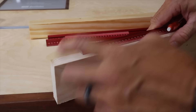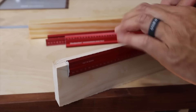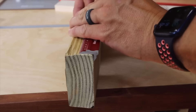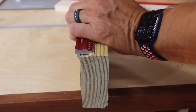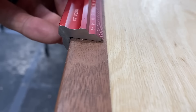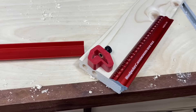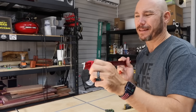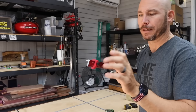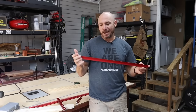Another great feature is that because this side is three-eighths of an inch wide, you can find the center of a three-quarter inch board really quickly. If you're finding center on a two-by-four, this side is three-quarters inch wide — you just hold it square on the board, mark against that edge, flip it around and use the other edge the same way, and you've got center every time. These are made out of aluminum — extremely strong. They come with stop blocks, though those are plastic, which feels like they cheaped out there. If you're only going to get one, I recommend the 24-inch.